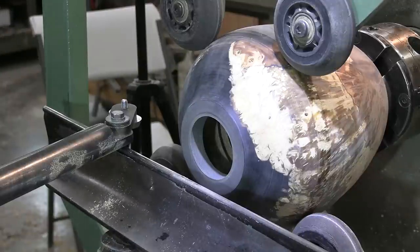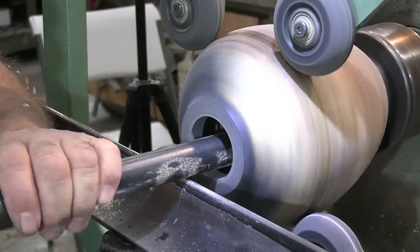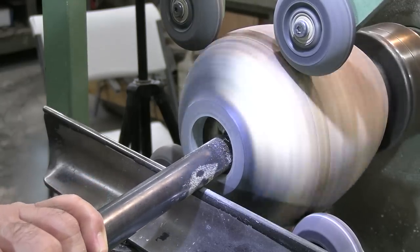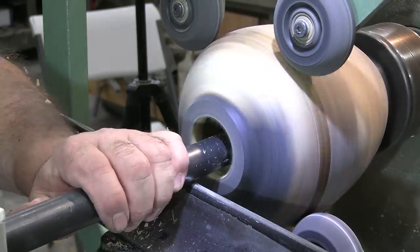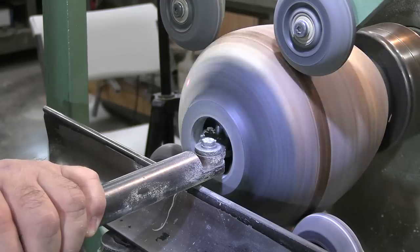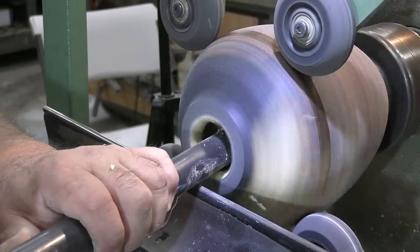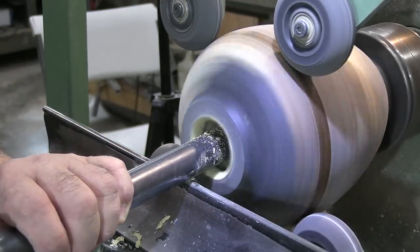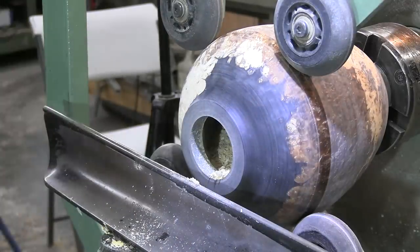I want to point out that I'm putting that little extension in there and I was able to use that for the rest of the urn - no bent bars or anything. The great thing about that boring bar is it's very robust with very little vibration, where smaller bars tend to vibrate more especially the right-angle ones. I rotated the cutter and it is doing well. Every now and then I stick my finger to make sure nothing has moved, because if the laser moves and you don't notice it, you could go right through the side of your project.